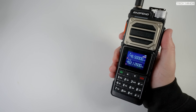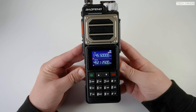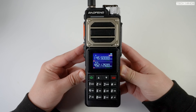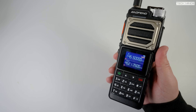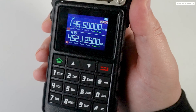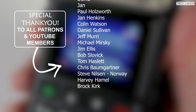Sorry this whole video is a rather short and basic overview of the Baofeng UV25, but when I realised that the spurious emissions are illegal on any radio, I kind of lose interest and don't really want to go into too much detail because I just can't recommend it. You may be wondering why I made this video — well, it's really to help you guys out. If you're looking at this radio online and thinking about buying it, at least by watching this video you'll know that on the two metre band you're going to be transmitting spurious signals at almost equal power, which is essentially illegal in most countries. Anyway, hope you enjoyed the video — hopefully next time we'll find a radio with a clean output. Catch you later guys.